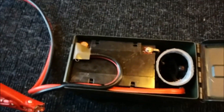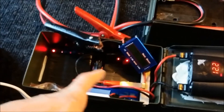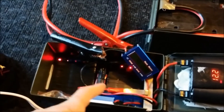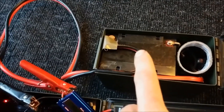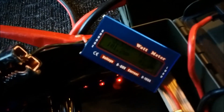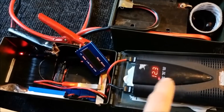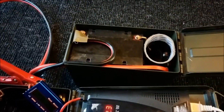In this video I'm doing a comparison between a 35 amp hour sealed lead acid and a homemade lithium polymer battery bank to see which one has more usable power. I've got my load on it — just my computer, like all my videos — and I'll be gaming off of it, which will pull about 15 amps from the battery.